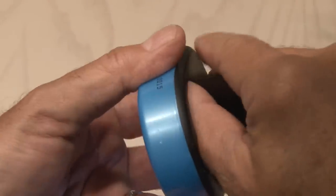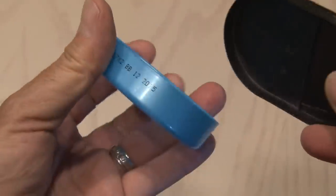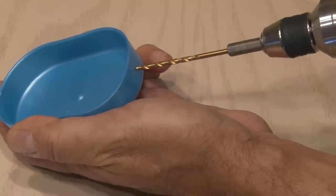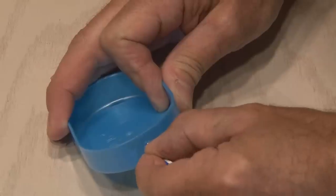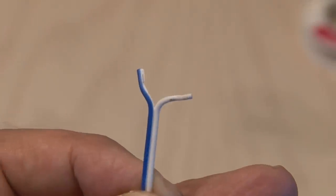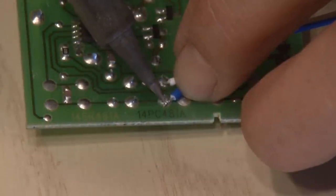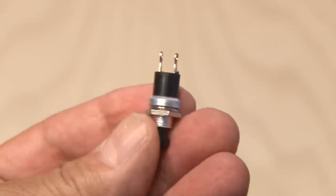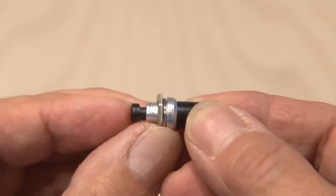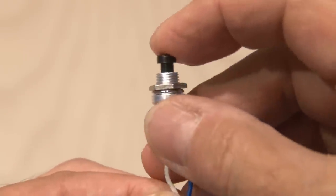The little box I'm going to use is actually a candy mint holder, which is perfect. There's plenty of room inside, and I'll show you a special feature in just a second. Using a drill and a small bit, I drilled a hole in the end of the box. Then I fed one end of our double-stranded wire through the hole, split the ends of that wire, and stripped the leads. Now it's time to solder those two wires to the switch on our garage door opener. I'm using a basic momentary switch that you can find online for cheap or at your local electronics retailer. I've soldered the other end of our double-stranded wire to the switch.